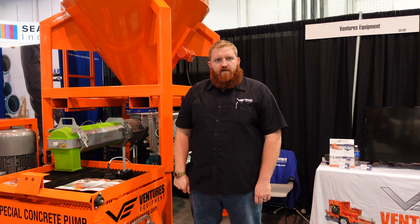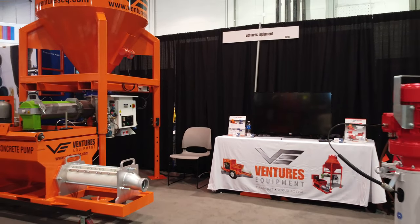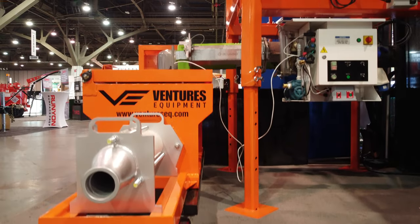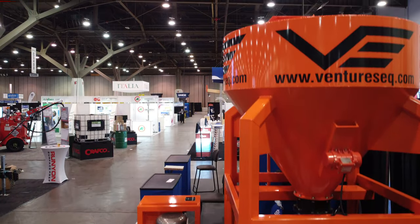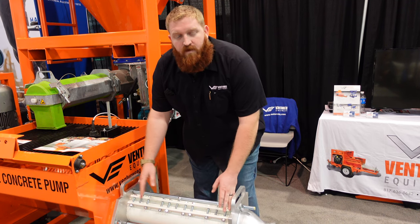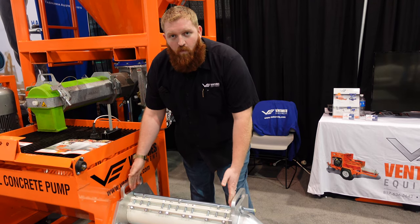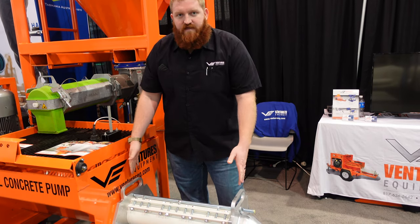This is our 2L8 rotor stator with an adjustable stator. As the stator rubber wears, you can re-tighten it to maintain peak pumping pressure. You can get two stators per one rotor — each part costs $900, so the rotor is $900 and the stator is $900. We highly recommend keeping a spare set on the shelf since this is your main wear item and costly to overnight. With a spare on standby, you can swap it out in about half an hour and be back to full pumping.